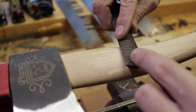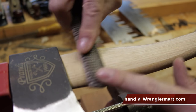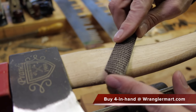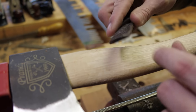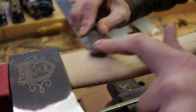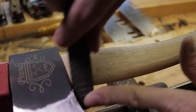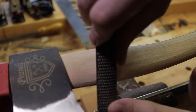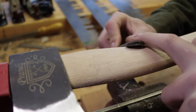Now we'll hit it with the four-in-hand. The four-in-hand is going to leave a much rougher finish, and the other thing I'm not a big fan of is that to use it effectively you really have to go across the grain with the knife or the spokeshave. We go with the grain - that's how it's best to work with woods. But the way this cuts, it almost needs to work at it obliquely across the handle. It's also very effective - I cannot say I do not like this at all - but if you have something that's really a showpiece, really special, that you want to do the nicest you can, I think that scraping is the best.